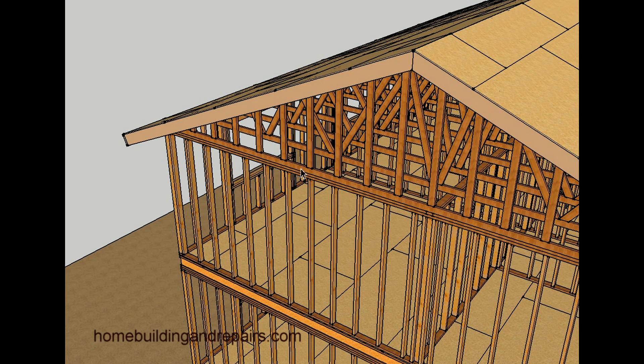And that's not good. Over here, we don't have a lot connecting to it. So this right here is actually a hinge point unless we put additional bracing on — attach it to the roof trusses. An engineer will sometimes call out for flat two-by-fours, maybe eight feet long, spaced four foot on center. These two-by-fours will attach to the top of the roof truss ceiling cords to provide additional bracing. I've seen plenty of homes built like this where they only have one wall connecting everything and nothing ever happens — these houses never fall down.